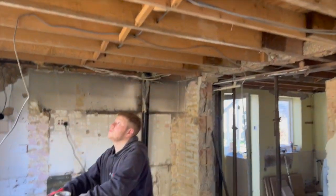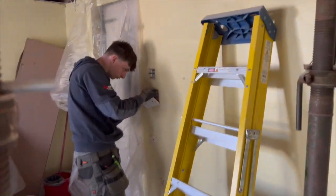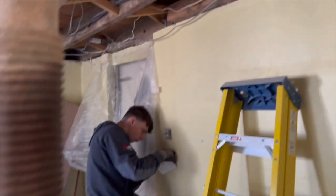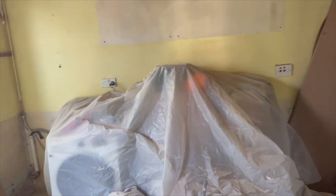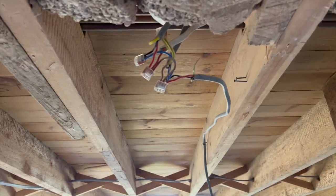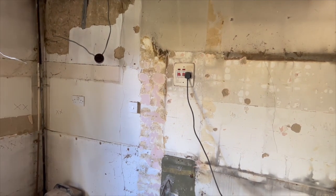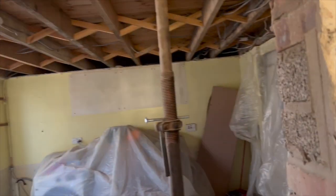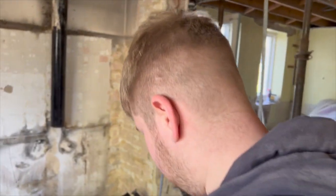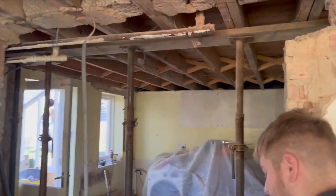We're at this job - me, Ollie and Hebzy today, making good. It's a kitchen diner. They're knocking down this wall as we're here. We went and cleared out the gear from that other job. We're isolating all the power, doing all the lights and getting it all sorted. It's all being completely rewired - kitchen diner and then upstairs using the ring main. We've got to get rid of all that. We're here for about two to three days to completely first-fix it.